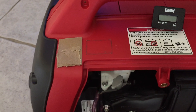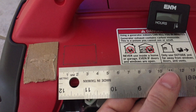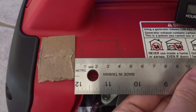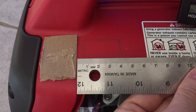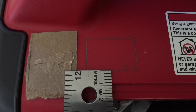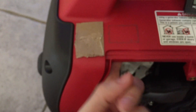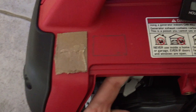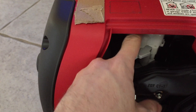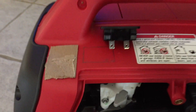I'm going to go ahead and put this back together. This is where I've decided to mount the hour meter — from this edge where it sort of comes straight up. If I put a piece of cardboard there, it's about five millimeters from that edge to where I'm starting the hole. The hole itself is going to be 36 millimeters long by 24 millimeters wide. From the edge here, it's about nine millimeters from where I'm starting the hole. I did feel under here so this should hopefully avoid any of the ribs under the plastic. So let me get the Dremel and cut this hole.